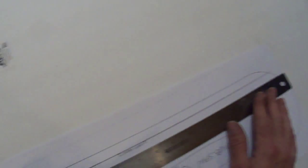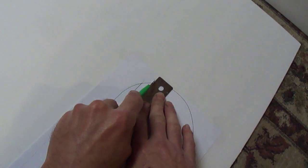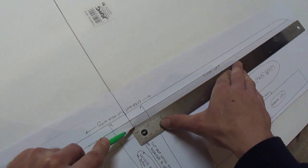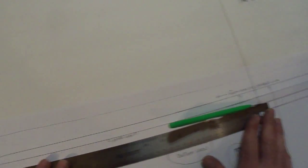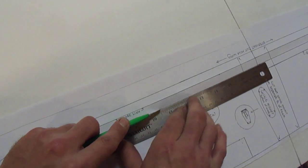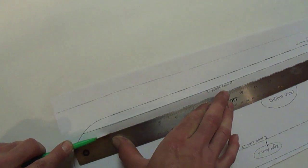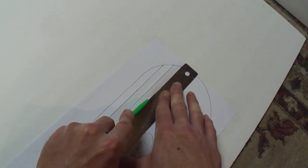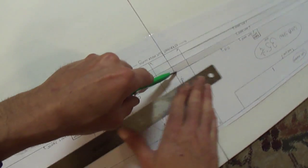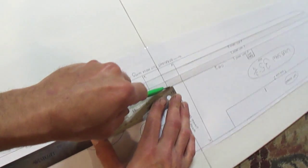For this build, I'm going to go ahead and show you how I go about painting these planes. So there'll probably be like a part 4, maybe even a part 5, I'm not even sure. So again, I'm just scoring these lines all the way down. And this is what we're going to set our airfoil off of. This wing is built the same way I built the wing for the biplane with snow skis.